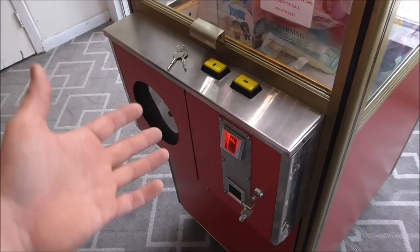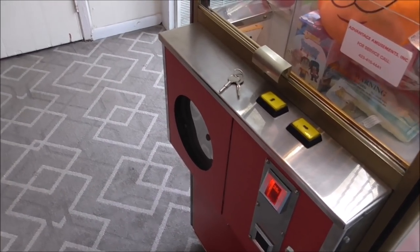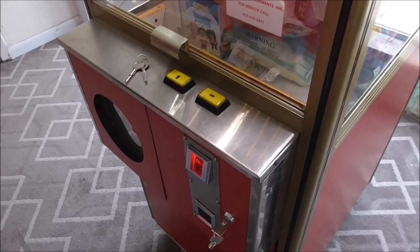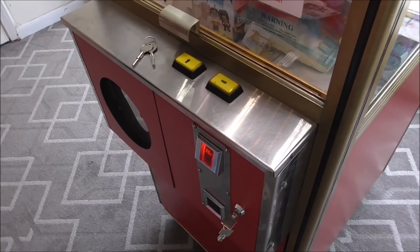They need to be 26, 28 volts, something like that, or even higher. You saw how the unregulated voltage got even higher in this one. But you can't put just a regular 5 or 12 volt light bulb in it that we usually use in arcade machines, because it will burn up. So don't do that.